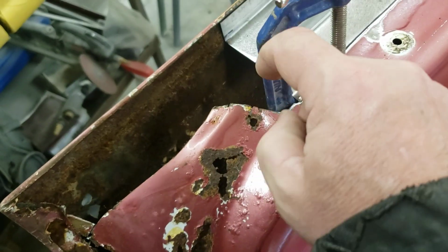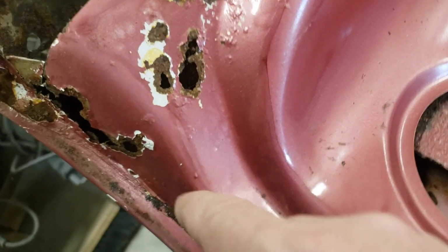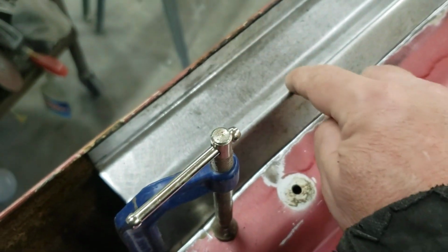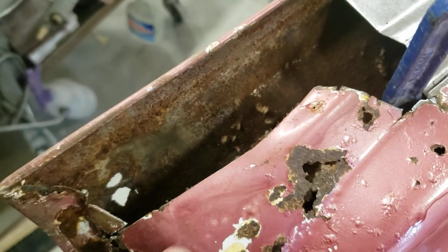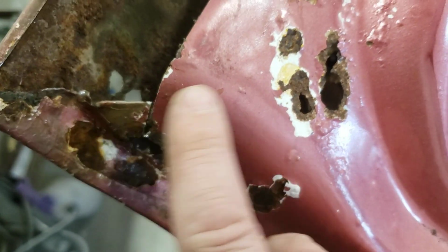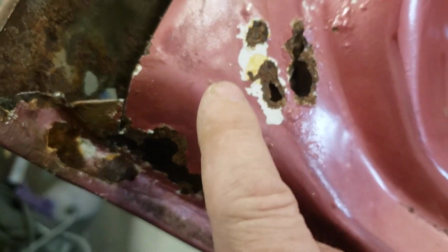So once that's welded, we'll take this off. We'll do a cardboard template. We'll do that in a flat piece. Then we'll make a piece resembling this up to about here. We'll run that across the back. We'll overshoot it so we can slice it and bend it down. And then we'll make this end piece in here. We'll make it a little too big.